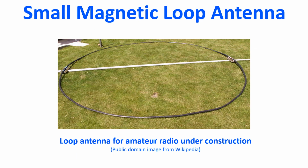Small magnetic loop antennas can be used both indoors and outdoors. They are cheap, easy to build antennas which have been used for even DX contacts with an indoor antenna running 50 watts for CW, PSK, JT65 and FT8 modes on 10 to 40 meters according to K5IJB.